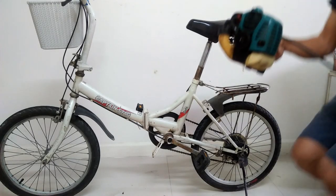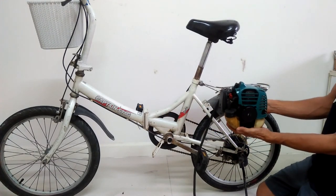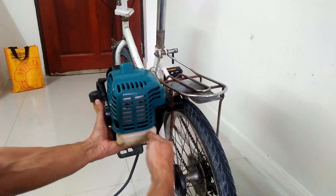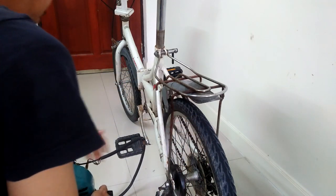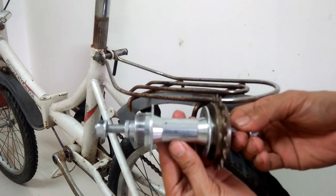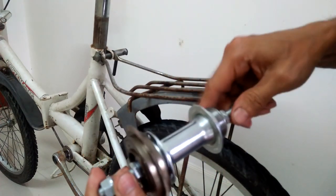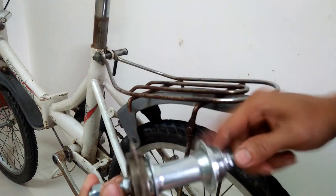This is my Japanese folding bicycle. There are tons of videos on YouTube of weed eater powered bicycles, and most of them simply mount the engine to the side of the bike like so. This additional weight offset at one side will make the bike unbalanced, and that effect is more noticeable with my small bikes. So I thought to do it differently. This is a cheap bicycle rear wheel hub I bought together with a freewheel sprocket — it has built-in bearings at both sides, which comes in handy for what I'm trying to do.